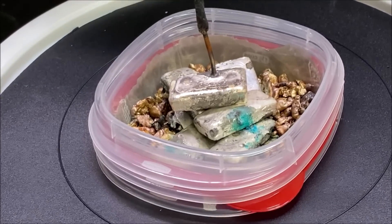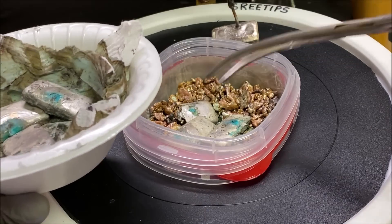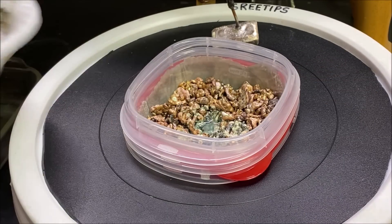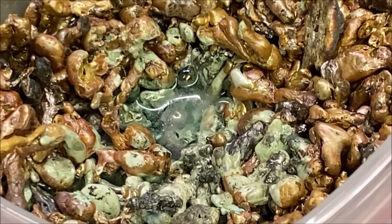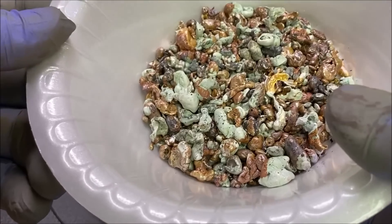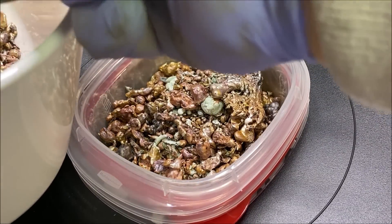We've consumed a little bit of the silver out of there. Let's go ahead and pull the anode electrode bar out of the way. You can see the electrolyte peeking through the impure silver shot — that liquid right there is the electrolyte from inside the silver cell. I'm going to add some silver from the anode filter basket we replaced a while back since it still has some decent silver in it.